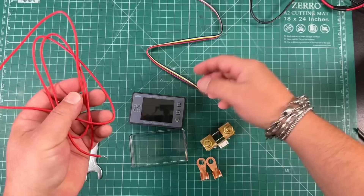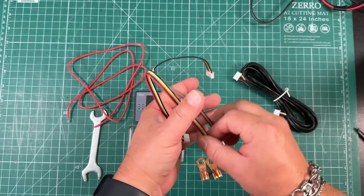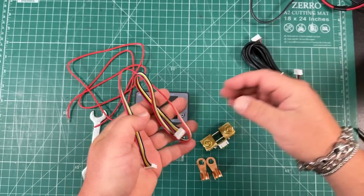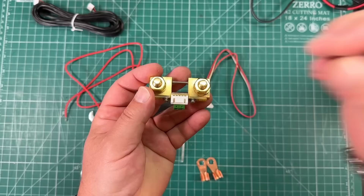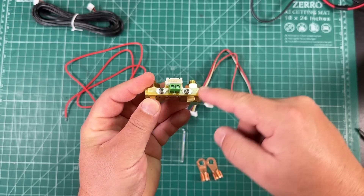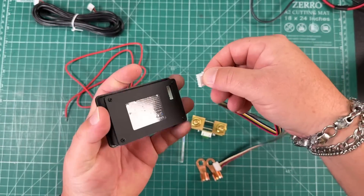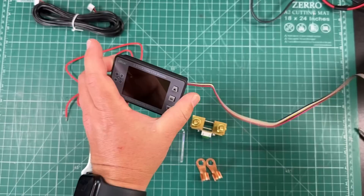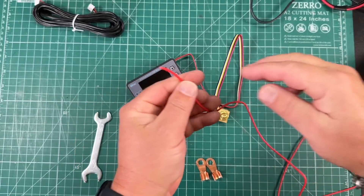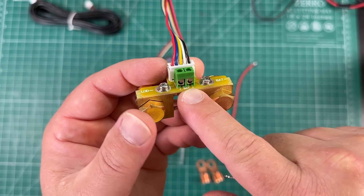You also get two different length control cables — you only need one or the other, a longer one and a shorter one. Here is the shunt; I went with the 100 amp shunt but they do make larger ones. The battery connects here and the control cable connects here. This thing is stupid easy to set up — basically all you do is take this ribbon wire, plug it into the back of the meter, and plug it into your shunt.